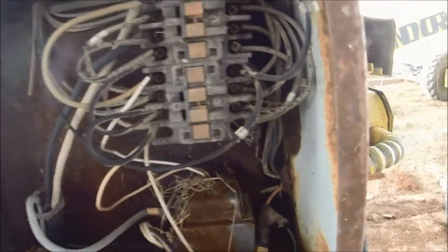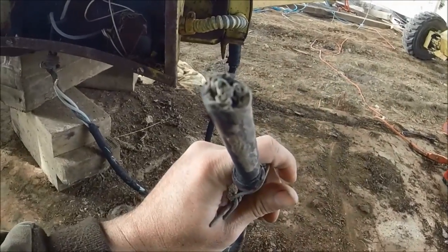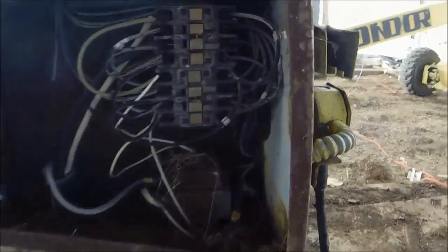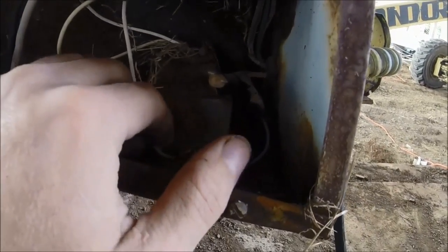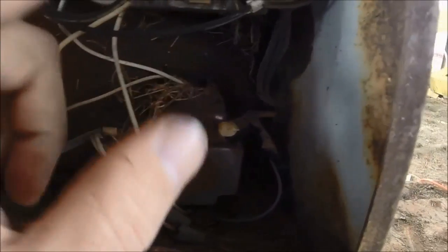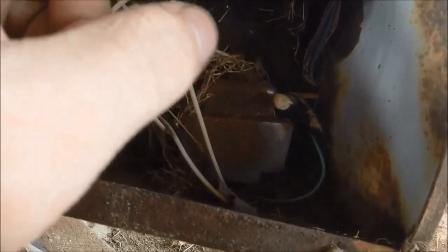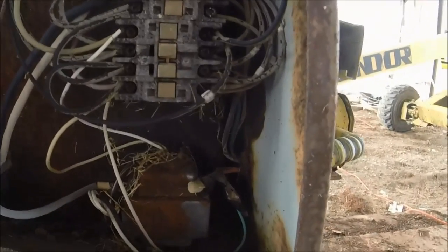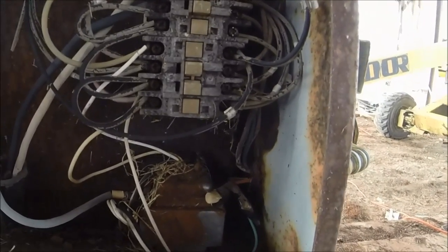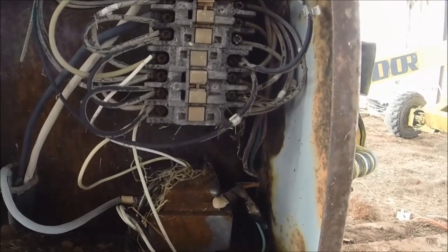But maybe that's in the pendant — which we had no pendant. We just got four wires in there. Coming back out of those four wires, we've got two: one goes to each of these contacts, and then another one is wired into this transformer. The transformer also comes out to here and here — that's a contact there. Not sure if that could be wired to only power up when the contact is closed.